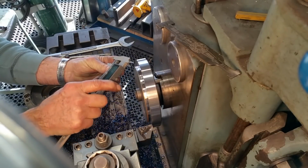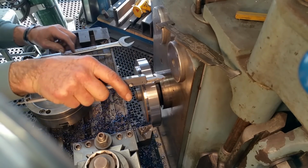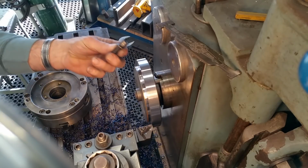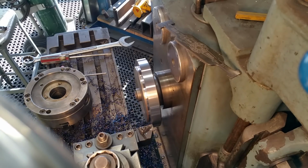I measure a washer and all, that head's about a 1/2 inch. And we have 820 something, 25, something like that. And if we were to give a 1/4 inch of meat under our head, that would bring it to 3/4. So it looks like we have about 75 thousandths to go. All right, we're going to crank in another 40. Here we go.